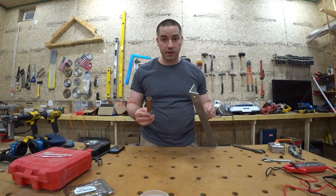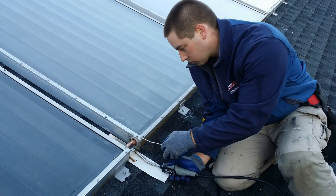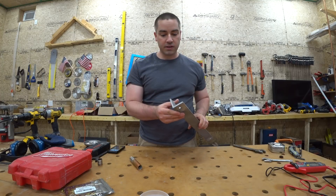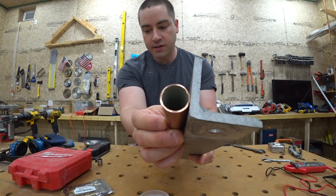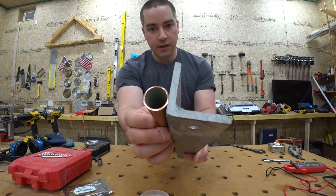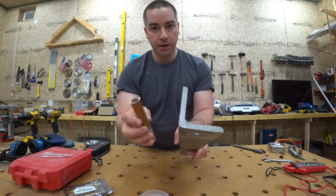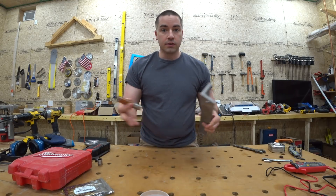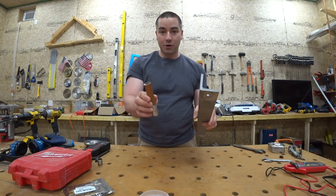I have a lot of scraps of both. The copper pipe scraps are from when I did my solar hydronic system for the garage and the house. I've got a bunch of these short little pieces, and a bunch of this aluminum angle, and this stuff is pretty thick. Looking at the cross section, the aluminum is a lot thicker than the copper, so I'd think it can handle more amperage. But copper has more conductivity and I don't have to worry about corrosion — so I've got a bit of a dilemma. Both materials I have on hand and I don't have to spend any money to get them.